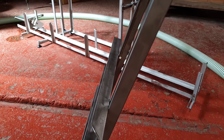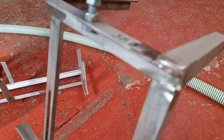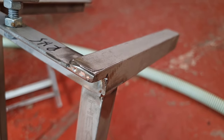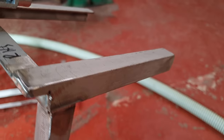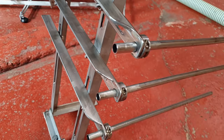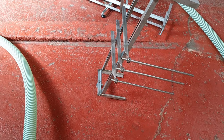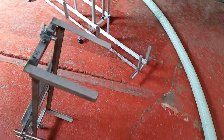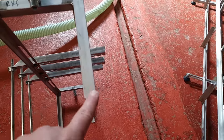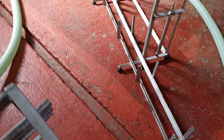We had all the steel apart last night for some pickling paste treatment to clean the welds up a little bit, so it looks neater and tidier around where we've scorched it. That's the fill carriage treated and ready to go back into action. I've also deburred all the edges.